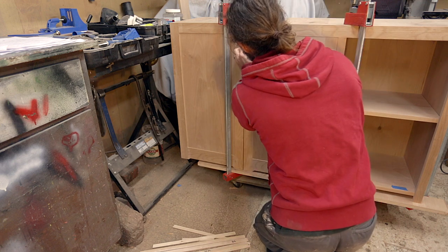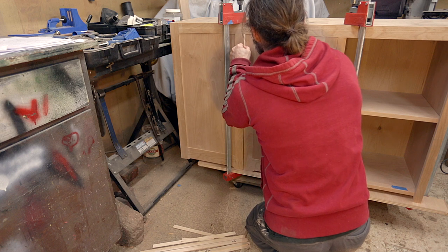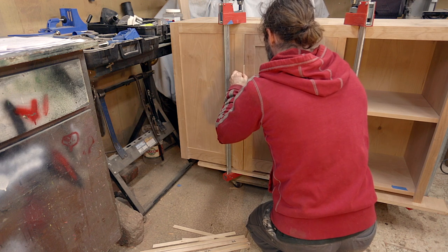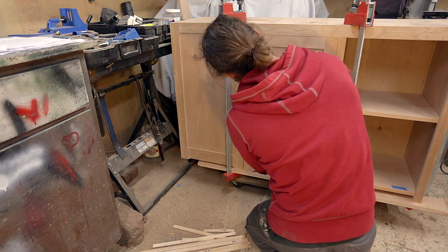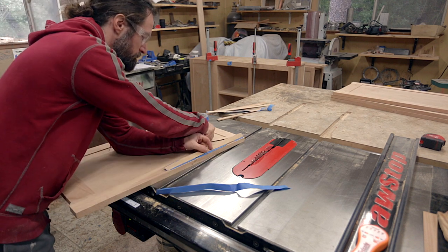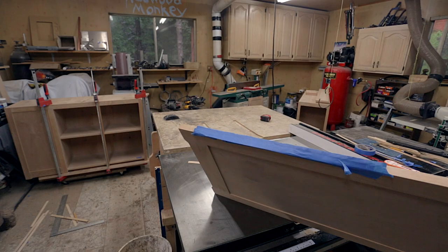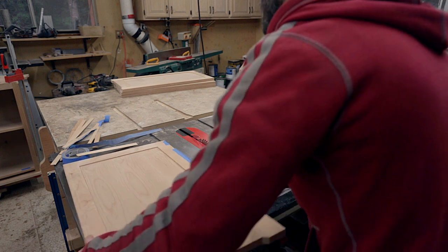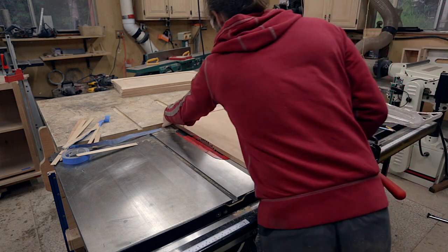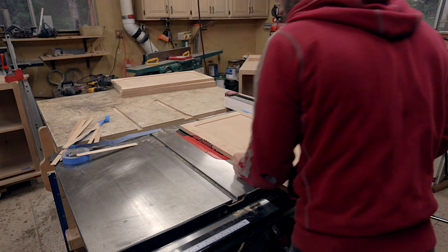I hold the door up and use the spacers as a guide to figure out how much I need to trim off. I want to get the sides parallel to the face frame first, then make it thinner if needed to have the same gap around the entire edge. I use the spacers or a framing square to draw a line of what I need to trim off. To cut a taper, I use some blue tape to build up a slightly thicker side — this pushes it out on the opposite side by about as much as the tape thickness. I add the tape, then run it through the table saw really close to the blade to see how much it's going to take off on that particular taper, checking against my pencil line. If it looks close, I go ahead and run it through.